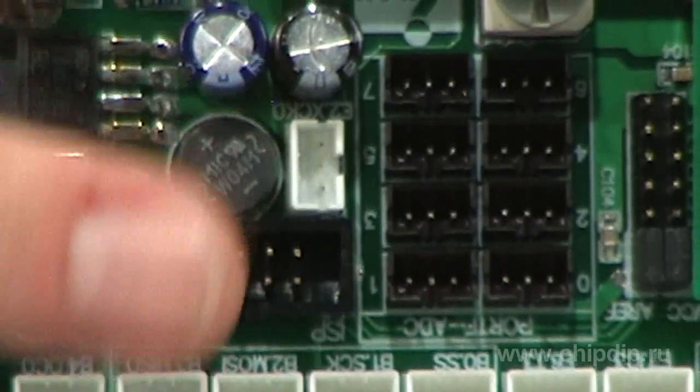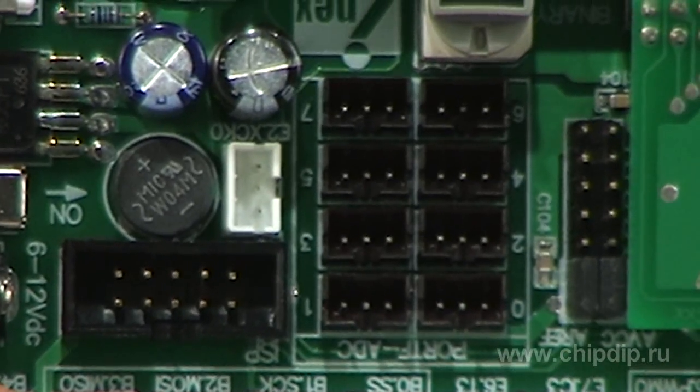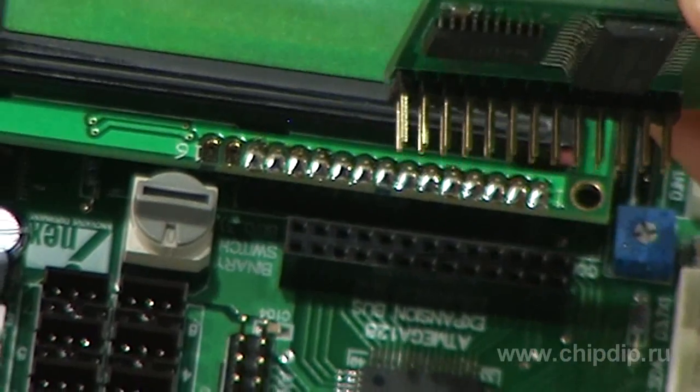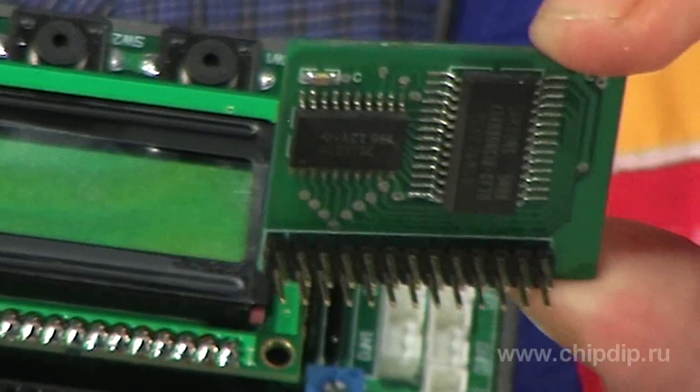Additional features include 4 push buttons, a character two-line LCD, 3 INEX standard pin connectors for various peripherals, a 32 kilobyte RAM and 32 kilobyte EEPROM memory module as a plug-in.